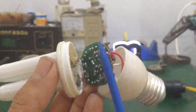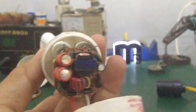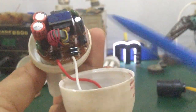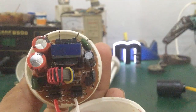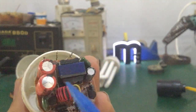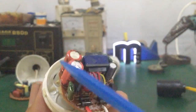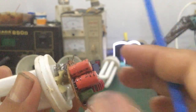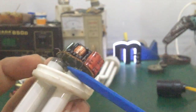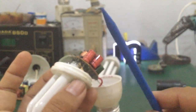After that, check the filament heating voltage — or the filament warming voltage — from the electronic ballast, to see if it's present. If there's no voltage, then the PCB board is faulty. If it's faulty, you need to check the rectifier voltage level, whether there's burning or damage to the rectifier diodes and the power supply section. Also check the voltage after the rectifier bridge to confirm.